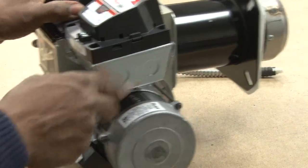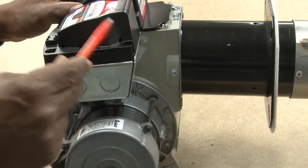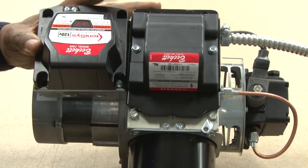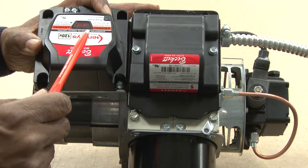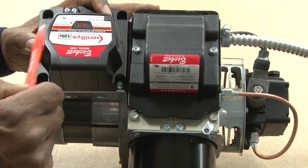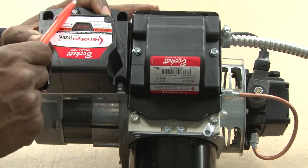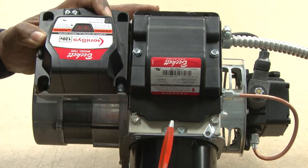This here is the primary control, used to prove that there is operation. It controls the pump and controls the electrodes turning on and off by the thermostat. We bring the control wiring from the thermostat to this to cycle on the burner. You can see the components now.